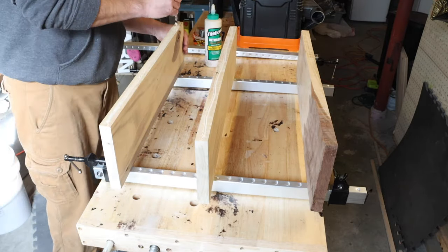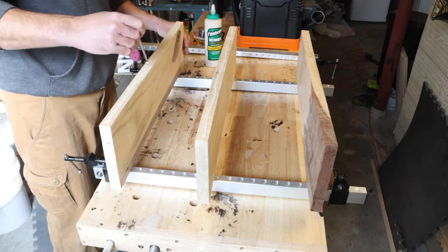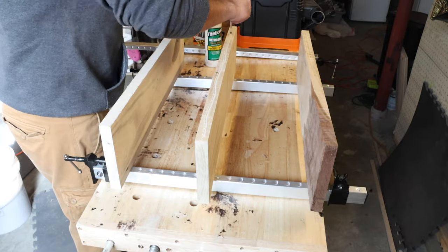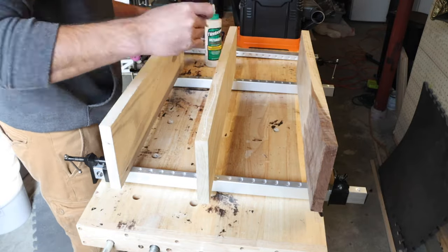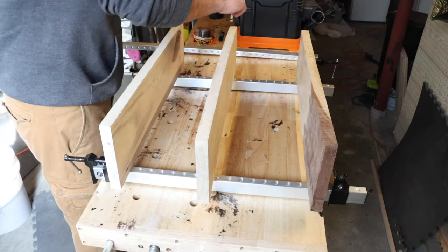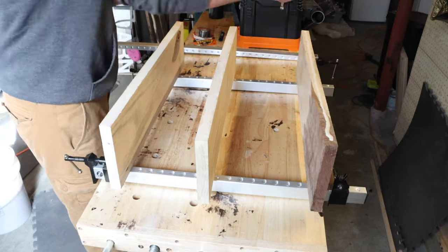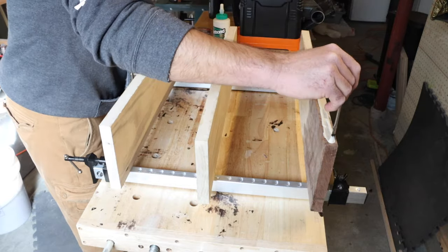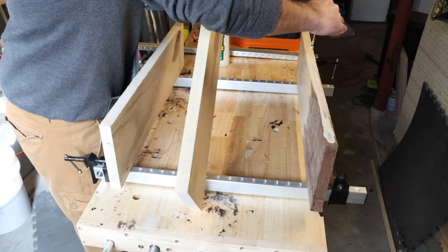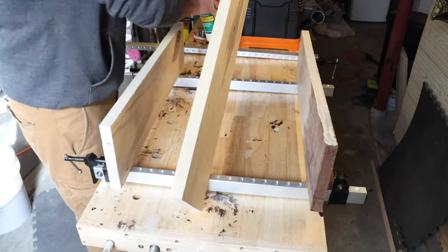This one is in thirds, so I'm doing both sides of it because I am gluing this up. The others I just trimmed up one side — the side that I'm gluing together. The other side I just kind of wanted to leave pretty rough. Now I'm just applying my wood glue. I get a little overzealous on this last one, so I just spread it and get both sides — not just one edge but both edges that you're gluing together.